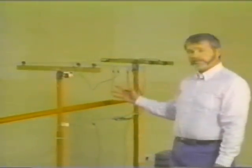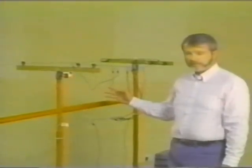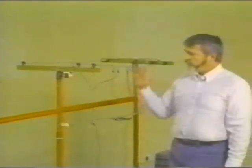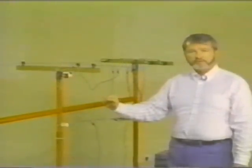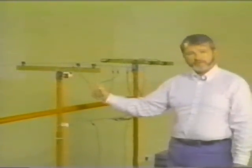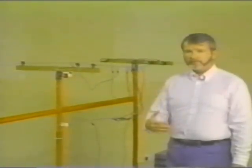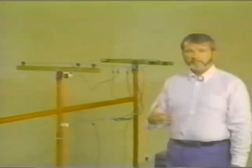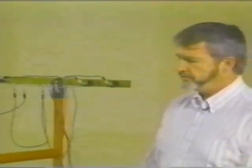It doesn't matter if you have a dozen grounds on that line and they're all between the man and the source. Unless you create a zone of equalized potential, if that circuit is re-energized, there will be a voltage drop across that man. And if that voltage drop endures for only a very short duration, it may be enough to produce catastrophic results. In anticipation of some of your questions, let me make one or two points.